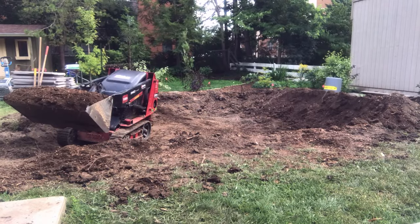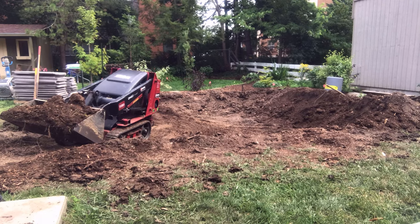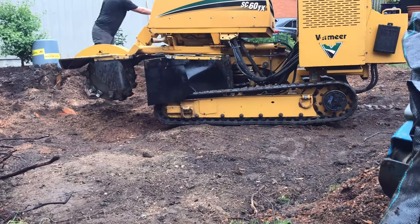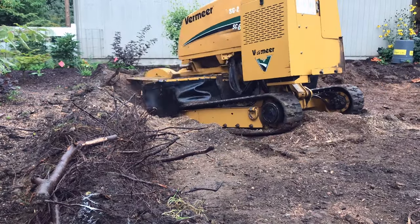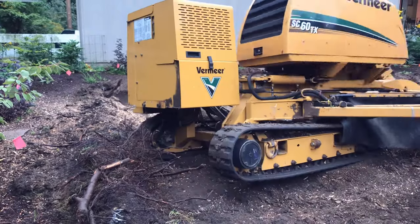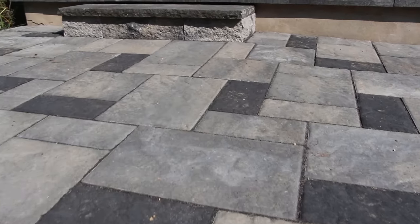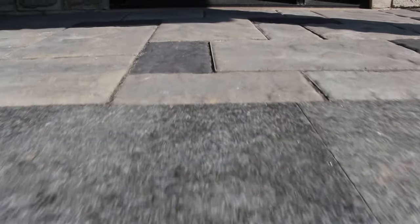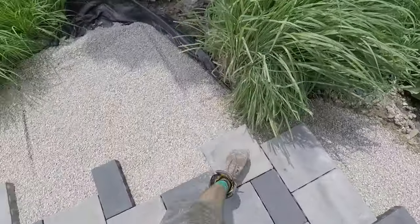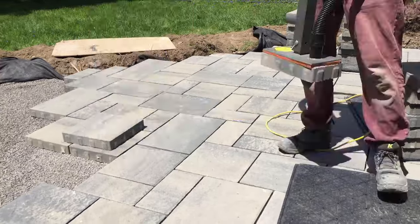Additionally, we're not going to use synthetic base panels on a project where we're digging more than five inches of topsoil. This rarely happens, but it has happened where we start digging and hit a lot of organics or even a tree stump that needed to come out. In that case we had to remove a lot of organic material and would opt for an open graded base if applicable. For front yard walkways we're also not using paver base panels, because typically we're tying into a driveway and want to match that base material — typically a dense graded base. A raised front walkway would be treated like a raised patio with an open graded base.